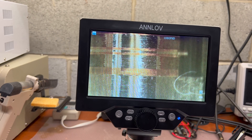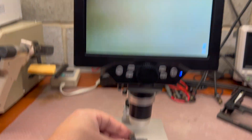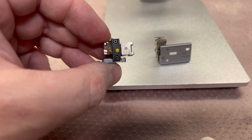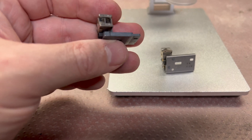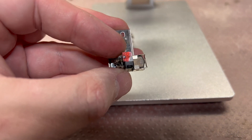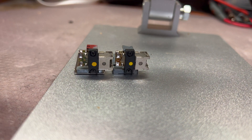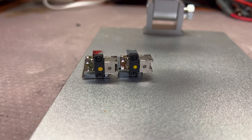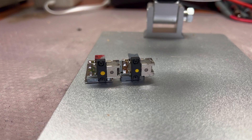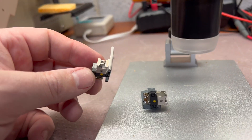I'm doing my best to understand what is driving the loss of high frequencies in this head. The 682 head has a yellow dot, and the 680 head has a yellow dot too - so they've been a higher grade, meaning these heads were selected. For me, this looks like two very similar heads. I was replacing the same on the Nakamichi 680 and I got really great results - after replacement, my deck plays frequency response like new. Let me replace them.